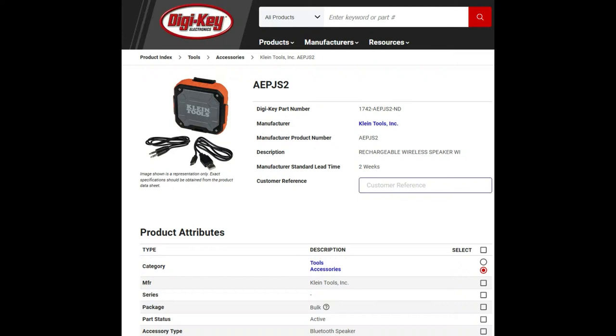very happily. But one thing I've noticed is we've moved from Bluetooth Classic to BLE for a lot of devices. A lot of the gadgets that you have that use Bluetooth, if it's not a keyboard or audio, it's using BLE. And that's because Apple had this restriction: if you wanted to pair your device with an Apple iOS device and it was Bluetooth Classic, you had to go through the Made for iOS or Bluetooth certification because everyone was using the SPP protocol. And so it got very complicated to add Bluetooth Classic devices, but with BLE you really don't need any permission at all. Any app can connect to a custom BLE profile.